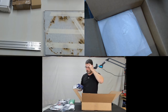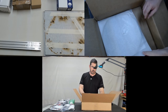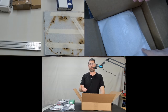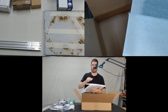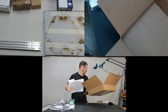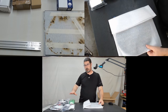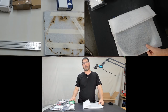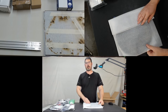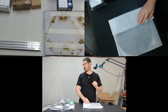If you're not familiar with the Rostock 3.2, let me talk about that just a bit. The Rostock 3.0 was SeeMeCNC's flagship printer, and the 3.2 is an upgrade to that—the '3.2' being a play on words for 32-bit, hence the Duet board. They've also upgraded the steppers to 0.9 steps versus 1.8 steps, upgraded the hotend to their new HE300, and a bunch of other stuff. I'll have a link below if you want to check it out on SeeMeCNC's site. The kit is going to be a blast to build and I'm going to walk you through every step of it.